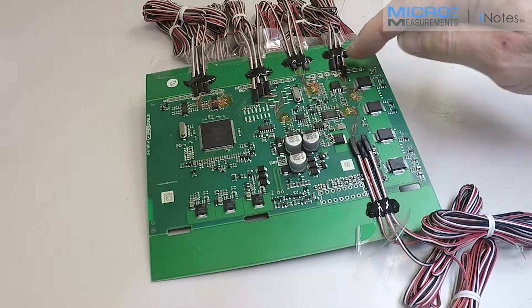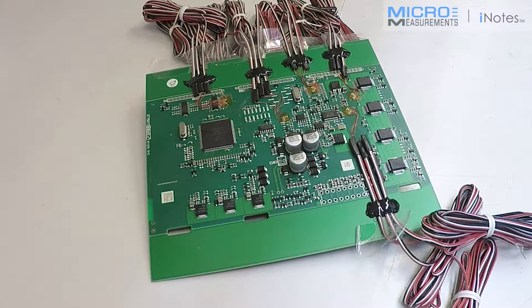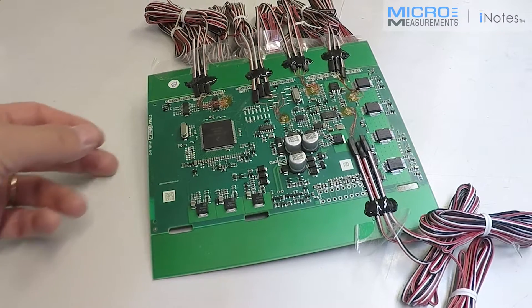And what's the lead wire being used here? This is as the C2A is manufactured — the wires that came with it? Yes, straight out of the packet with three metres of ribbon cable and the red 134 already attached. So the installation here is purely a bonding process and then we anchor the leads again with a two-part epoxy which we've used quite extensively — it works well for us.